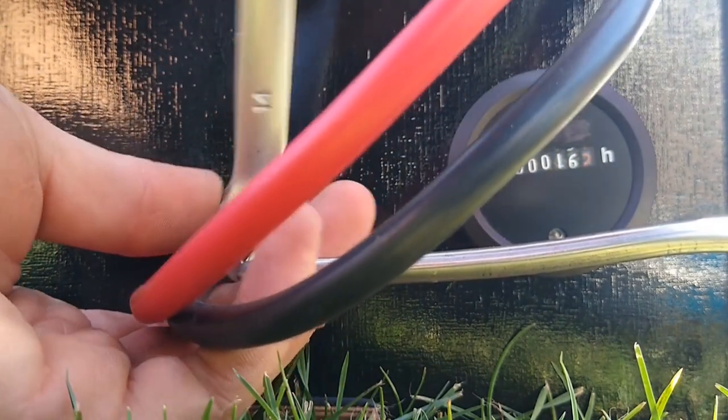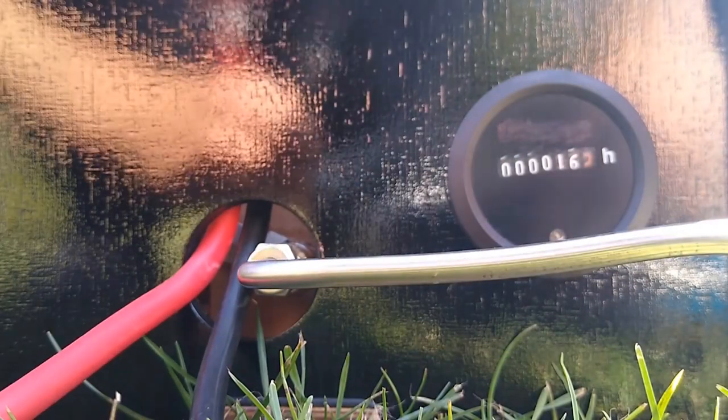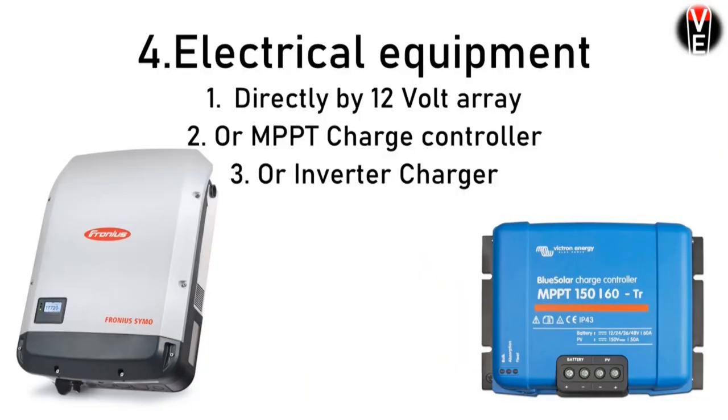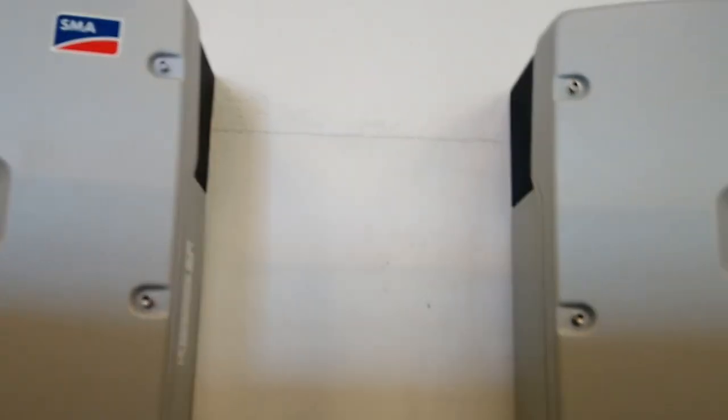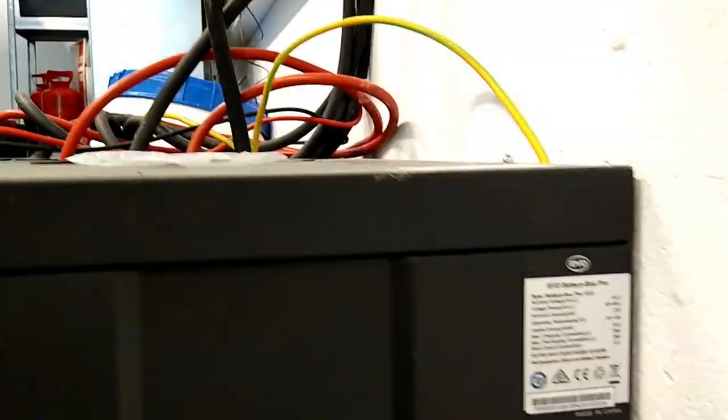These cables go into the electrical equipment. You can actually run an electrolyzer directly on a photovoltaic array, because an electrolyzer is a DC appliance and 12-volt photovoltaic modules can be branched directly to the electrolyzer. It will just turn on when the sun is shining and turn off when it goes down. I use this MPPT charge controller.